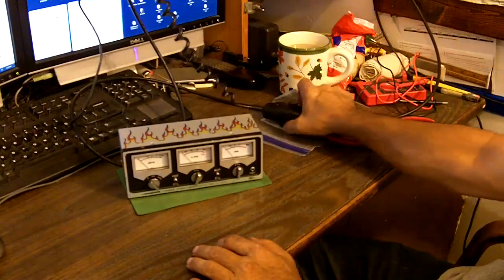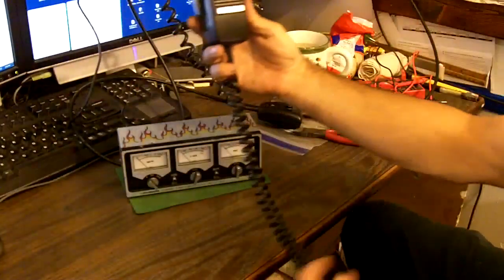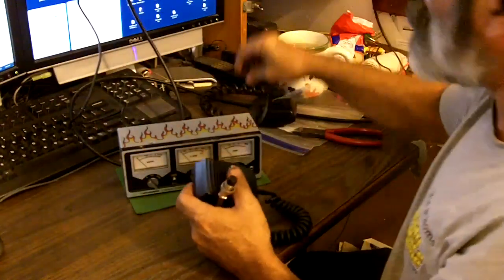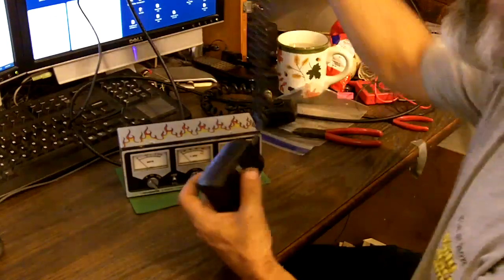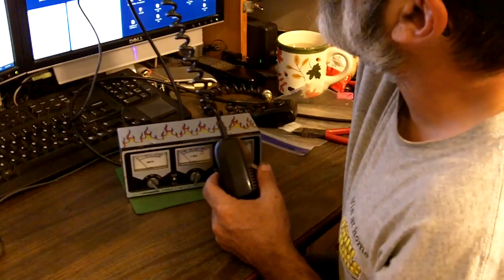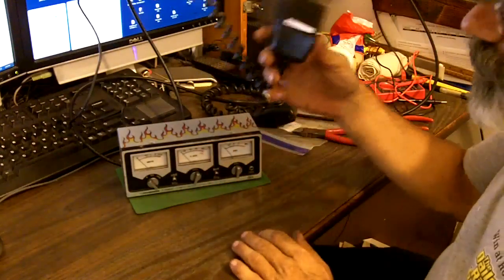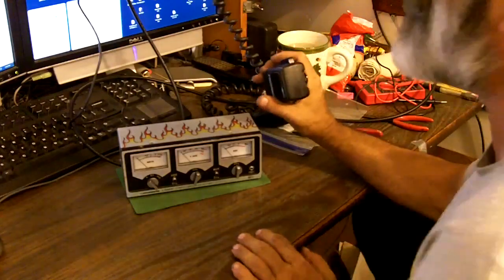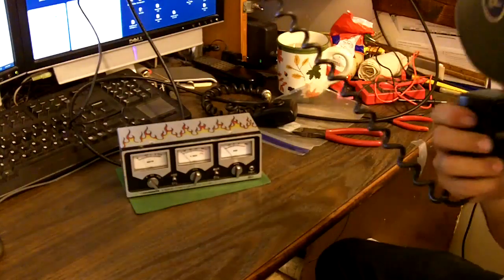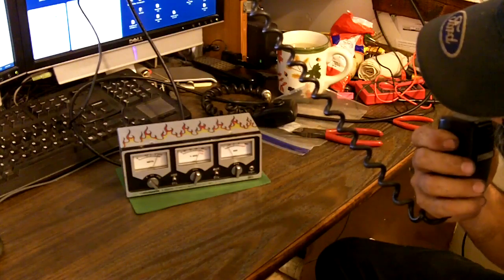What do you think? Want to try a power mic in that Washington while we're right here? Let's give it a shot. We'll grab the old Cobra, because it's wired 5-pin. This is the Uniden Washington, so they have the 5-pin, unlike the President Washington that had a 4-pin. Receive got a little quieter. Has anybody else ever noticed that? Sometimes the sound of the receive changes a little when you change mics. I've researched it and haven't completely figured out why yet. Someday maybe. Alright, testing it again. Look at that. With regular audio, we're hitting almost 100% there every time with the power mic.